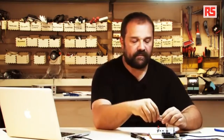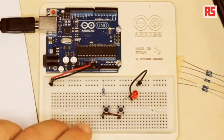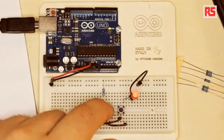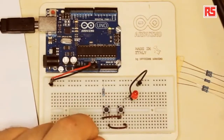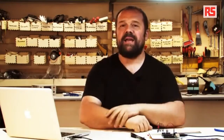Let's see what happens if we put these two push buttons in parallel. I'll connect one leg of the first push button with the same leg on the second push button, and do the same for the remaining contacts. Now if I press one button, the LED comes on. If I press the other button, the LED comes on. And if I press both, the LED comes on at the same time. By creating two different paths for the current, I just need to press one of the two buttons for the current to reach the LED. In series, you need to press both buttons at the same time. In parallel, you need to press one or the other. In a way, this small circuit creates a very basic logic circuit.